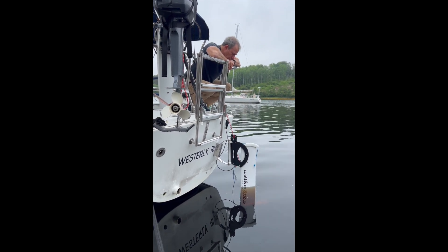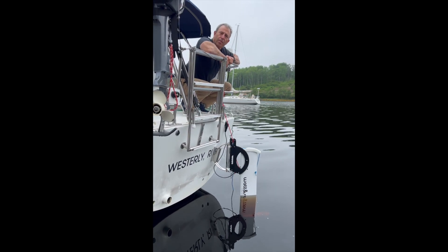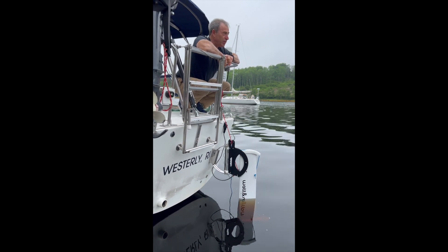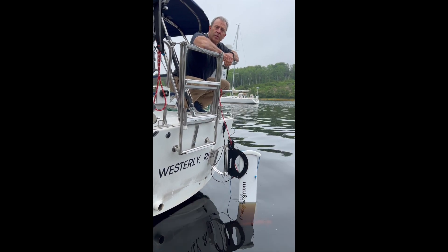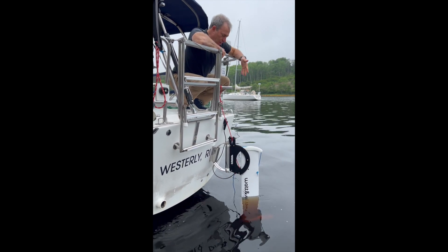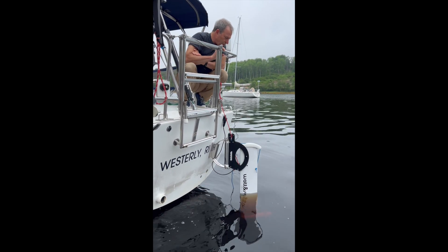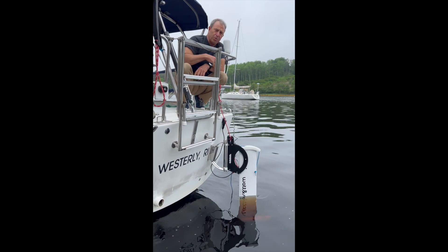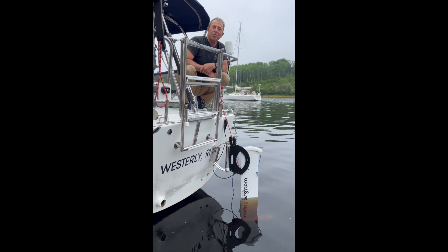Getting over seven knots gives about 15 amps at roughly 14.4 volts. They've got a charge controller — you can program it for voltage; there's a choice of settings. If you feel like you're getting overcharged you can just pull it out of the water. It's got a breaker so you can turn it off from inside the boat. There's also programming around whether it should spin fully or not, but it's in the manual, which is pretty good.